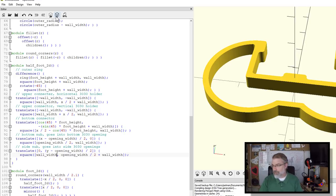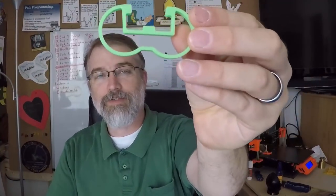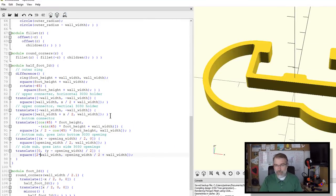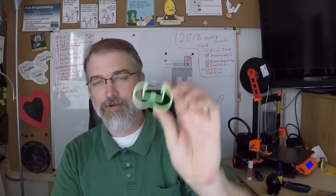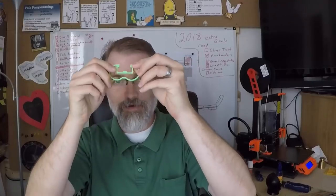Because of the increased nub size it can flex a bit as you put it in, so I could go further. My next attempt was to multiply wall_width by 2 — and that gives a bigger nub. I think that's going to work. It worked with a small test print, so now I want to print it big. I also adjusted the bottom nub — tried 1.5 times wall_width, then 2 times. I think the whole foot will have enough flex to pull and go in there and hopefully stay better.